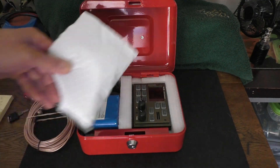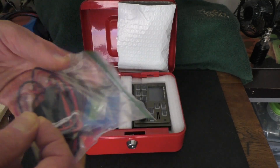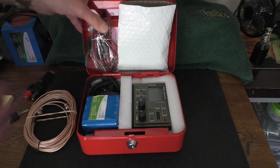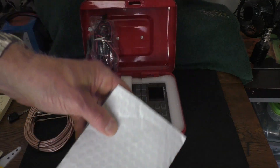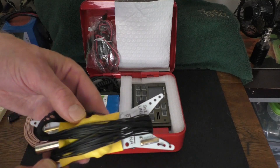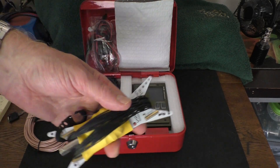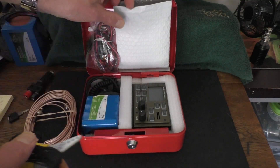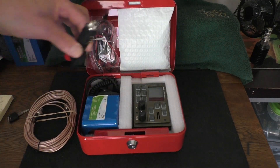You can see there's a lot of room in here to put items. Inside this pouch, the wrap protects the top of the radio when you close the lid. Here we have a Pactenna — about 29 feet long with a 9:1 balun. You can put it up in a tree in whatever configuration you want. It usually requires a tuner, but on different bands you can find frequencies where the SWR is really low. For those who don't want to use a tuner this could still be self-contained.